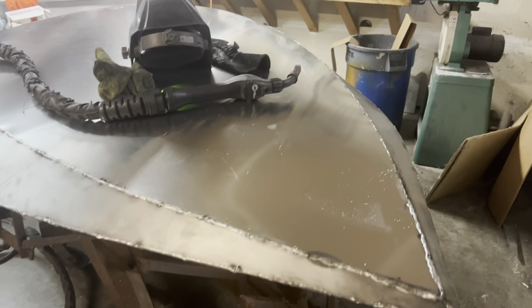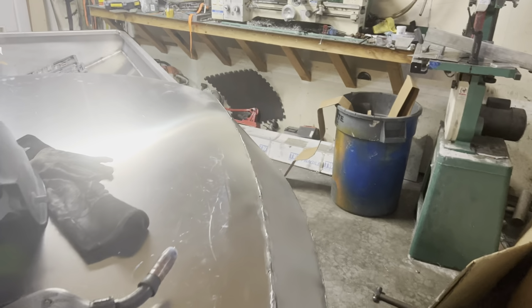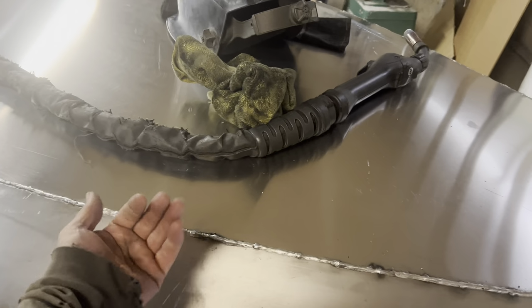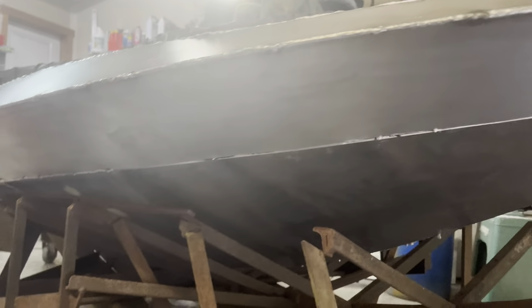All right, well, I had an issue with the microphone, so I'm gonna just put some music to a bunch of that stuff where my microphone wasn't working, but I got all these top outside welds. They're not the prettiest, like I said, doesn't matter. I just had to fill in that V in there. These will get ground, and then I'm gonna do weld on the backside, but I still need to get this seam up here welded, so I'm gonna do that right now.